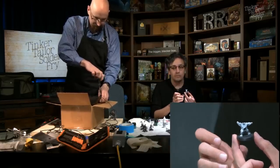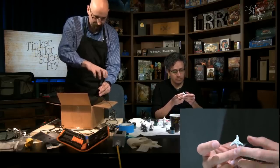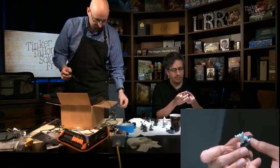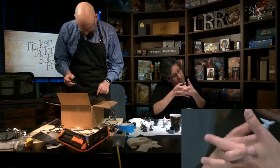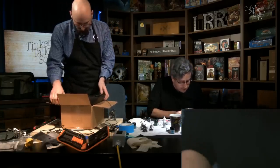Yeah. Contact cement, I always understood, was you put a little on one thing, a little on another thing. You wait until they get tacky, then you stick them together, and that's what's holding the pieces is the bits that got tacky. Yeah. No. Here, it's actually melting the surface of the plastic. Interesting. And then when the solvent evaporates, it binds again. Yeah, it binds.